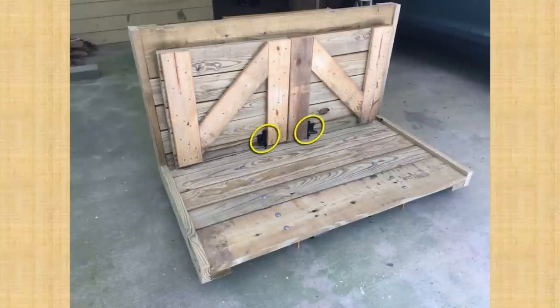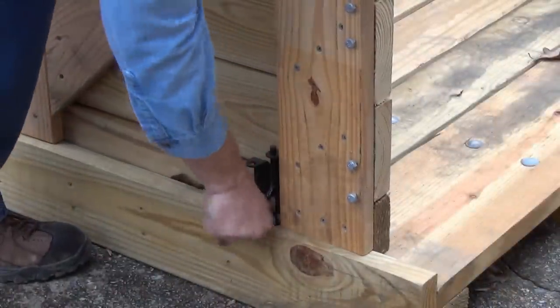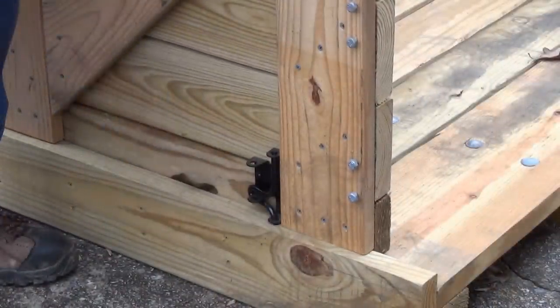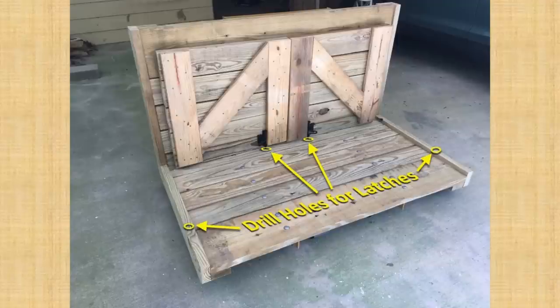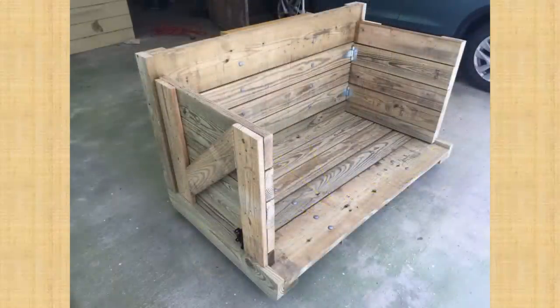The latches are slide-action gate latches, mounted high enough for the latch pin to clear the platform side boards. Here's a close-up of a side panel in the open position. Next, holes need to be drilled in the rear of the platform board and the platform side boards for the latch to seat in. You can easily mark for the holes by putting the side panels in the closed position and firmly tapping the top of the pin with a hammer, which will make an indentation in the wood where the holes need to be. Likewise, you can mark the holes in the platform side boards by the same method.